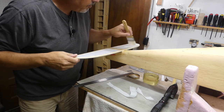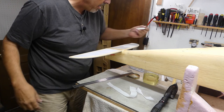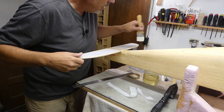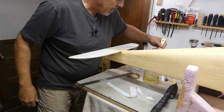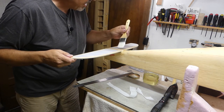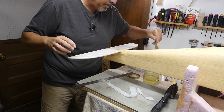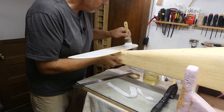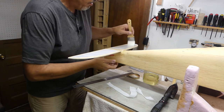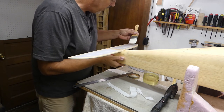Everything is properly leveled out — I'm about a sixteenth of an inch. I consider that good enough for where I'm at right now. That can get straightened out with the flying wires on the back. I just wanted to make sure that when this thing was glued together and put on — because it sat glued to the back of the fuselage for probably two months since I've been able to get down and start covering — it induced a little bit of warp in itself. I wasn't that concerned with it, and I knew I can get that straightened out before painting.